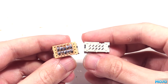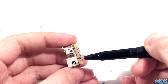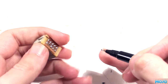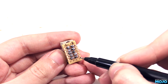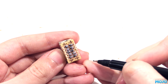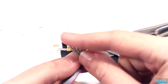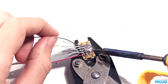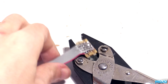At this stage we're not worried about where the pins connect to. We just need to mark pin 1, which has a nice little triangular marker. Pin 2 is the next one across, then 3, 4, 5, 6, 7, 8, 9 in the bottom corner and 10 in the bottom left. The ribbon cable we're using has a red wire at one end - this is pin 1, which connects to pin 1 on the connector. What we end up with is all the odd pins on one side and the even pins on the other. Solder it up and we've got a nice sturdy connector ready to fit.